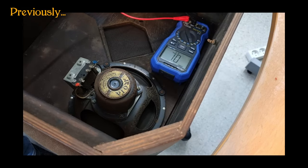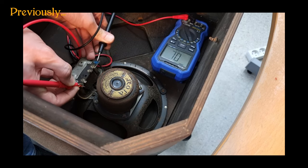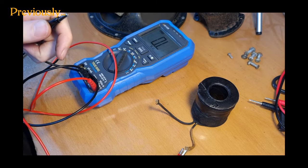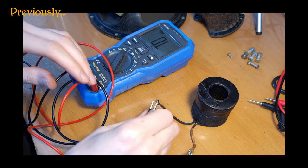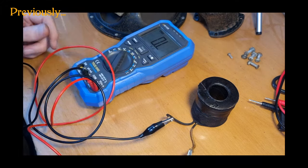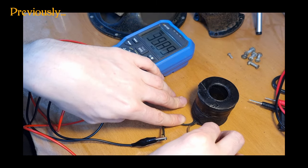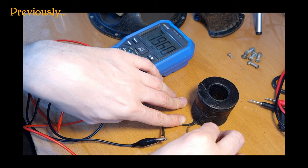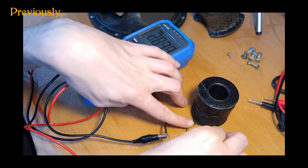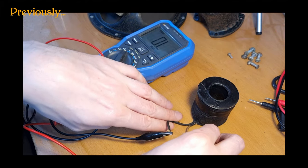I think I might have an open field coil here. Yeah, see, there is nothing. Absolutely nothing on there. To be 100% sure that we're not going to disassemble this for nothing. See, it's open. Oh, see, wait. If I push the wires, then, okay, it's a huge resistance that I'm having, like 50 meg here, but...